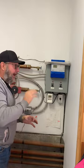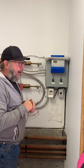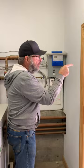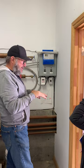We can go dry, and we can go dry plus, I think, all the way up to 9 hours. Somebody has added 1 hour of extra runtime to it, so maybe keep an eye on things. It's probably done for a reason. When you come out here during the winter and you see that that is dry, look at the rest of the driveway. If it dries at the same time, the object of the game is for everything to dry at the same time and cool down at the same time. But if you've got drifts or shaded areas, you have to run that extra hour.